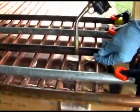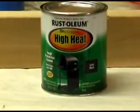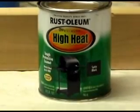You will spend about an hour soldering the copper sheet to the pipes. The soldering process causes the copper to ripple — this is fine. The other side of the sheet is the face of the panel. I sandblasted the face of the panel to roughen up the surface for painting. I used Rustoleum high-temperature paint without a primer and sprayed the face of these panels. I let the panels hang in the basement for about a month to let them off-gas before putting them into the boxes.